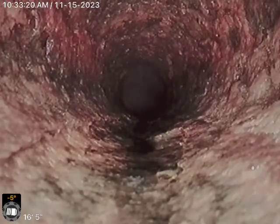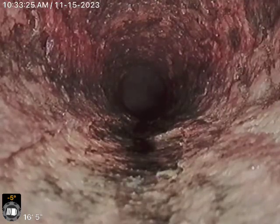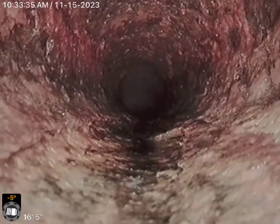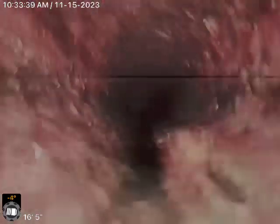Another option you can do as well is what's called hydro-jetting, where you use high-pressurized water to try and remove some of that buildup surrounding the crack, leave the pipe nice and clean, and also that root on the top — we can just go ahead and cut that out for you. Jose talked a little about that before, so thanks.